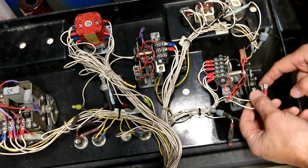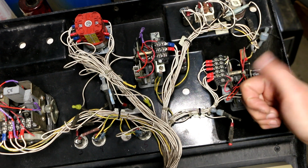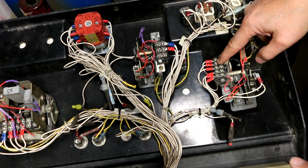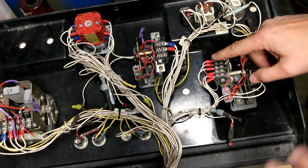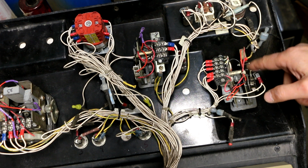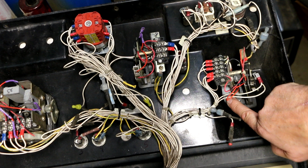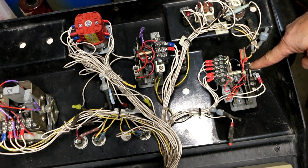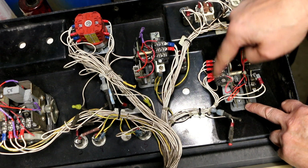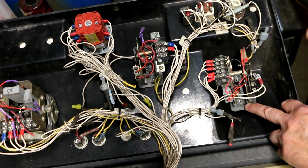Well, on this assembly, on the top of the controller, there's a pivot rocker switch, which is for steering. That's just a simple switch. So there's 3 wires right here that go up to that switch. So that's working perfectly fine, and there's nothing mysterious about how that works. The drive forward and drive back works just like the boom extend or the other things here. It's got one of these digi sensors right here that's in series with a micro switch right here. So when you go to push forward, it closes the micro switch and puts the digi sensor in circuit, and the digi sensor moves clockwise or whatever for one direction and counterclockwise for the other direction.